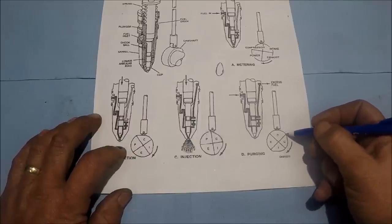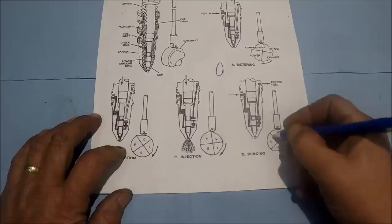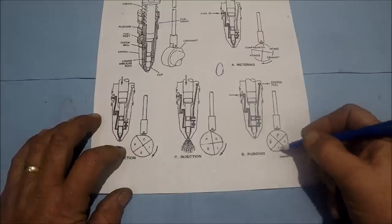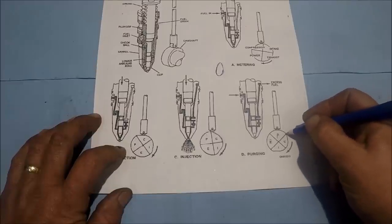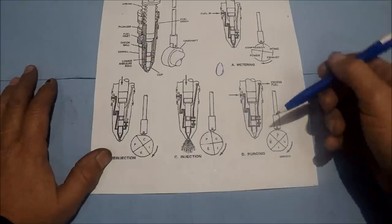the outer base, which is anywhere from injection through the power stroke all the way to the end of the exhaust stroke. That's supposed to be an E and a P. So anything between injection, which occurs about here, the cam's turning this way, you have the injector shut. And this is where the injector adjustment is critical.